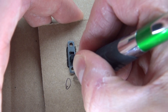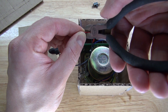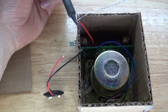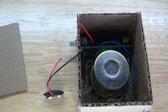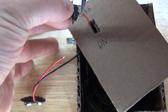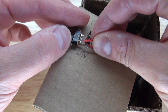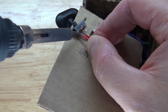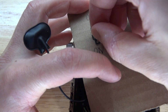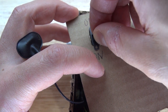I'm going to indicate on and off for the switch. Then I'll take my positive wire from my battery clip, cut it, remove the insulation, tin it, push both wires through the hole, and solder it into place. Next, I'll put some hot glue on the switch to keep it in place, and move the switch on and off rapidly to prevent the glue from sticking to the switch so that the switch will still work.